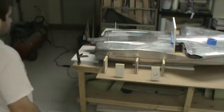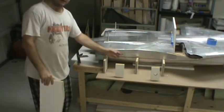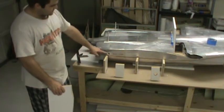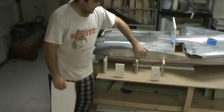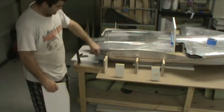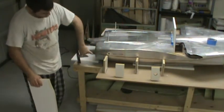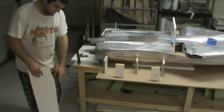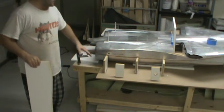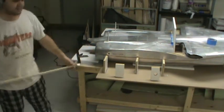What that does is the fuselage kind of has a little bit of negative draft on that side. That's one reason why I cut it in half a little bit down here instead of up here. But because it twists a little bit, especially here towards the back, if you leave it straight without that bevel, it hits the parting board and doesn't fit nice and tight up against it.